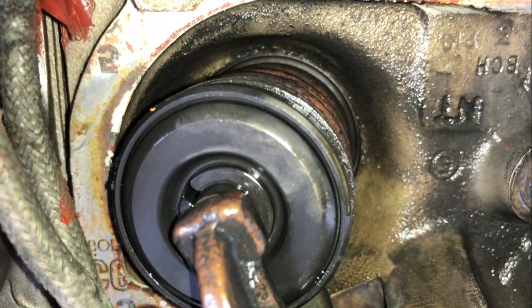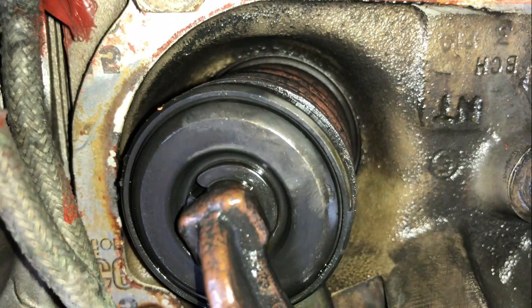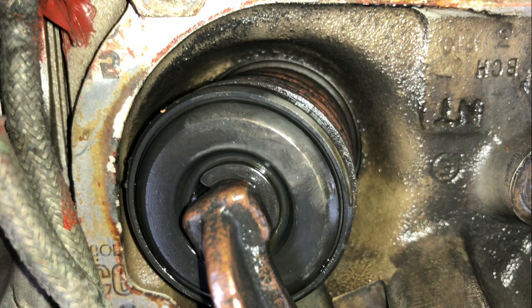There are a few things going on there. I suspect that the geometry of the rocker arm itself is partly to blame for that side shifting. It may be causing some wear in the guide itself. But I don't remove cylinders from service because the valves sidestep when they close — it would only be if it has an uneven heat signature. And even then it depends on the individual owner and the situation of the engine, whether I would lap the valve in place or pull the jug and send it out for overhaul or replace it.